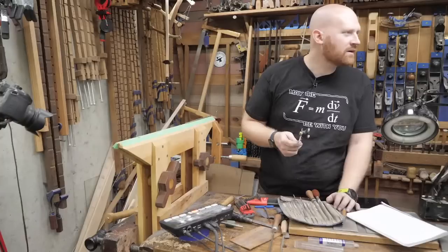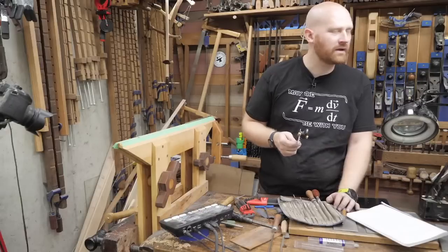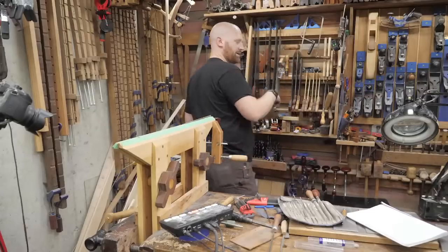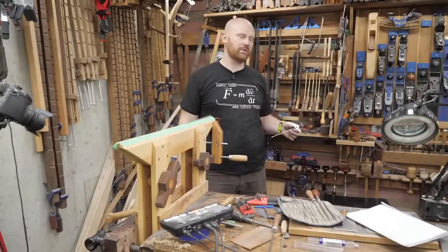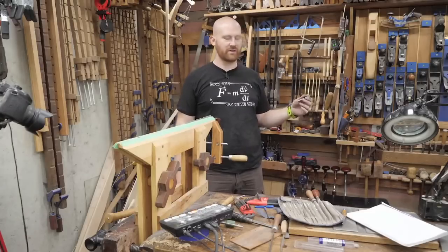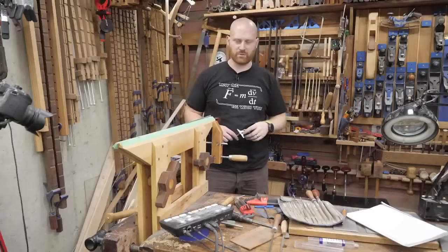It's just a question, as we see a lot of woodworkers on YouTube. Yeah. Most of the Japanese saws, the ones you buy on Amazon and most tool sellers, those aren't sharpenable. They're intended to be disposable. You buy a new blade for it. But there are historical, traditional ones that are intended to be sharpened. They're just a lot more work. If they have hardened teeth, then no, they're disposable.